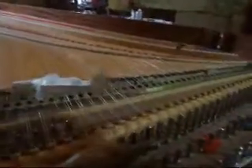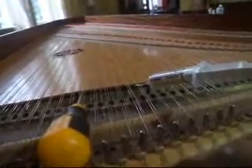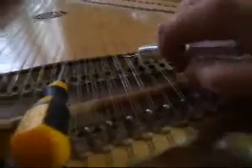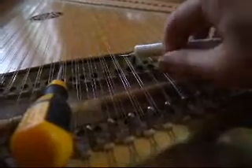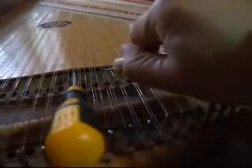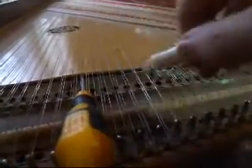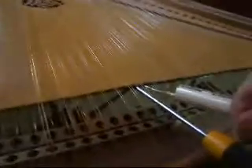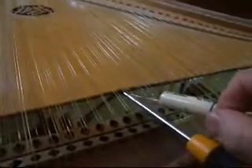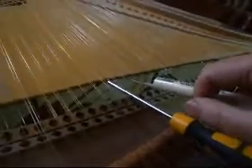Getting the glue in between the soundboard and the plank underneath is difficult. We've tried using a spatula sort of thing but this doesn't work. And so I'm using a syringe with a printer ink refill cartridge to get the glue into this space between the soundboard and the rest plank, and it's very difficult to squeeze it through the needle.